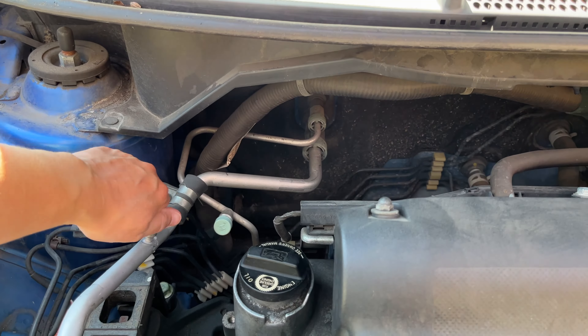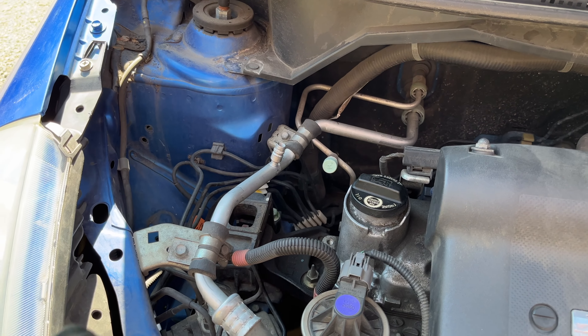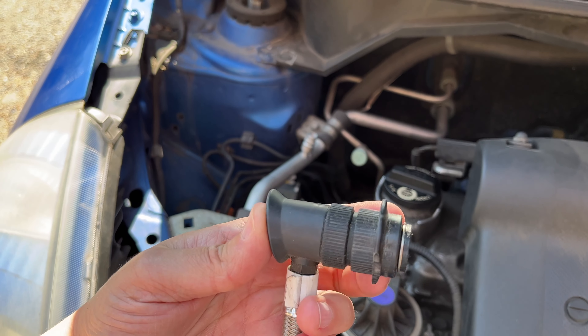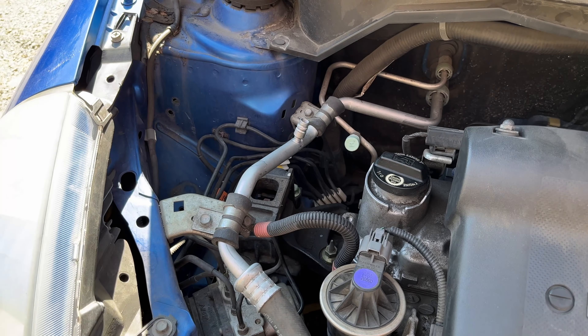I'm doing a voiceover here, so bear with me as the engine noise was kind of loud while I was doing this. This piece right here is the quick connect adapter. You just use your fingers and pull it back. It snaps right over top of the low pressure gauge. Pull that back and push it right down over top and it'll pop in and lock.